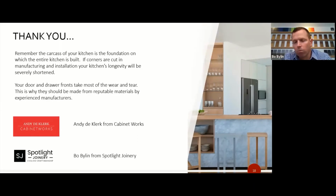When going with something more high-end, whether it be a walnut or an oak, the sides of your carcasses, because they are supported structurally by your base and your top, you can generally flat laminate, and that's available. You can laminate in a number of different ways. The biggest challenge comes down to the grain direction of your timber, and then also your backing. Your backing is generally the one that, with expansion and contraction, would push or pull your carcass in or out.